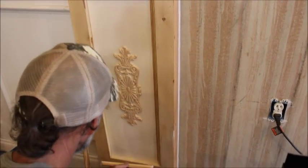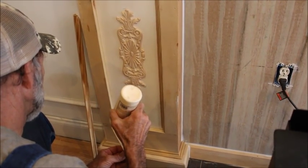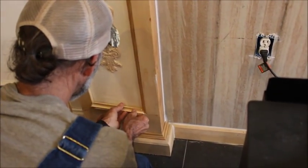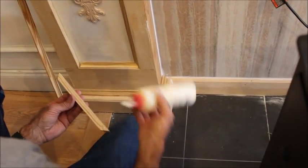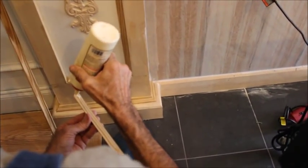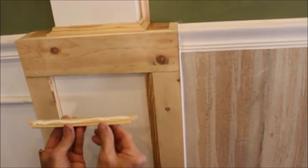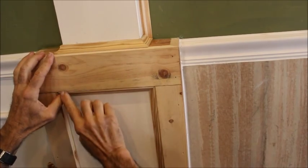I use a glue called Titebond — it's a glue that I've used for cabinet work for years and years, and I've never had it fail me. It's a really quick drying glue. As soon as you put it on and stick it to something it's pretty much stuck. A lot of times it'll fill up a lot of gaps when the glue dries, and it saves you having to do a lot of puttying. If something doesn't fit exactly right, the glue — if you put enough on there — will squirt out into those areas. You can see I'm pretty liberal with the glue because my goal is that it does not come loose and it actually fits tight and snug.